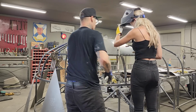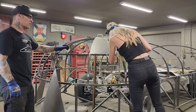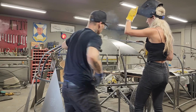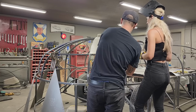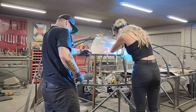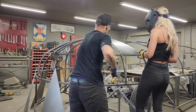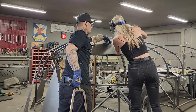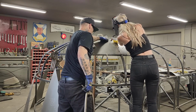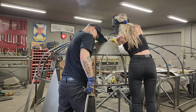Okay. Right there. Try to keep it up straight like this. Yep. Put your wire right on the square stock itself and leave it in the center of the square stock, and then it can melt both of them together. Let's do just one hit of that one. Go in. Do the next one. Just go ahead of it or behind it, whatever way you want to do it. Go in. Yep. That sounds like a real good one. Let's do the next one. Yep. Go in. Beautiful. That sounds real good. Next one. Go in.